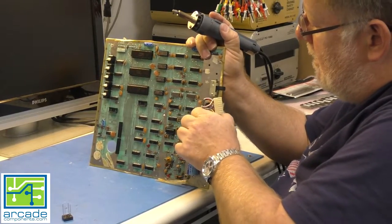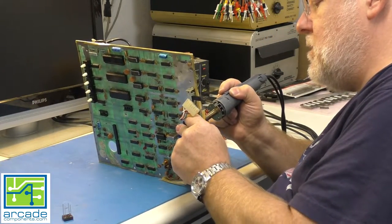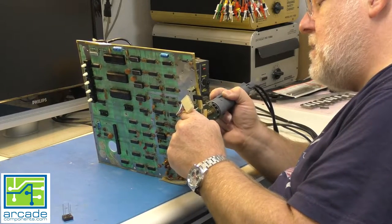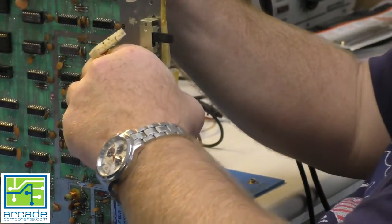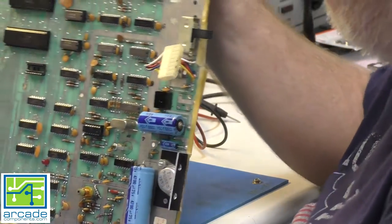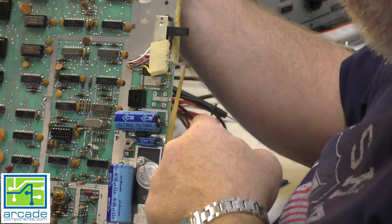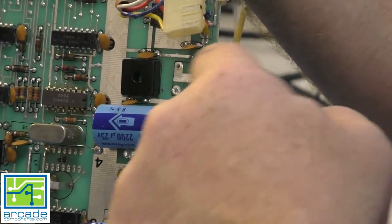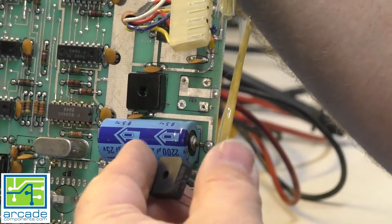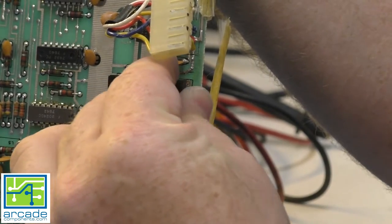The problem is we've got thick leads on this thing, and when it stops and starts to cool down they like to attach to the wall of the hole, so give them a little jiggle and jostle. There's the old bad one. On the plus side, this thing is marked nicely - on the circuit board we've got marks showing where the plus is, and diagonally across from that is the negative. The two across are the AC leads. We just turn this so the positive output of the bridge goes into the hole marked plus and solder it in place.